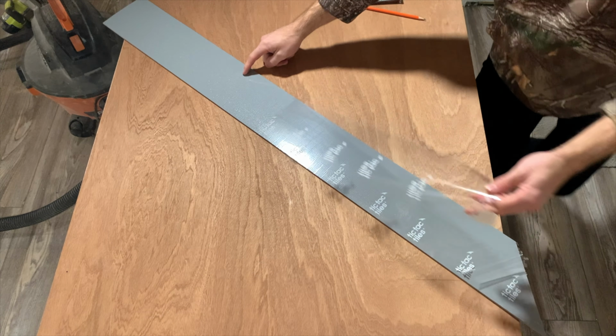After finishing with the front of the door, I flipped it over and I completed the backside, except I didn't do the chevron pattern. I just didn't feel like it. I just did straight boards. Now for the overhang, I just took a utility knife and I ran it along the edge. It cut off pretty easily, and I highly recommend something like this if you're doing peel and stick. If you're using real lumber, you'll obviously have to use a table saw or a circular saw.